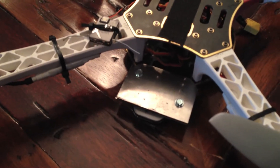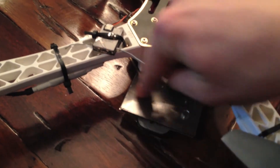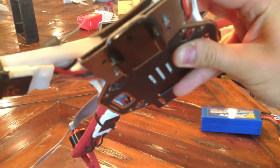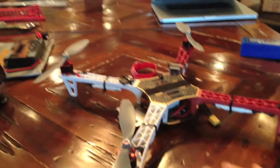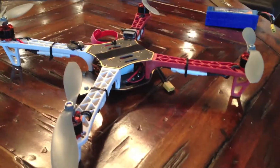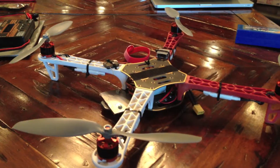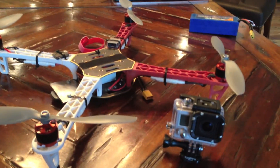Let me show you where I mount my GoPro — this has been a little bit of an issue. I crashed my copter and it actually broke off part of the frame here on the DJI. So I took two pieces of thin sheet metal and screwed them together with sheet metal screws. I know it doesn't look the most professional, but it works. I've got my GoPro mount sitting right there on the bottom. You can probably see the problem — when the copter is sitting flat and you put the GoPro underneath, the GoPro is the lowest thing. If you ever crash, the GoPro is going to be the first thing to hit. So I'm getting ready to order landing gear, which will help my copter sit up higher so I can hang a camera underneath. I'm also going to be working on getting a gimbal for my GoPro. Here's my GoPro — GoPro Hero 3 Black Edition. It takes great videos and great footage. Highly recommend it for a good, lightweight camera.